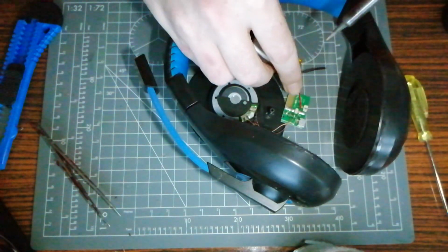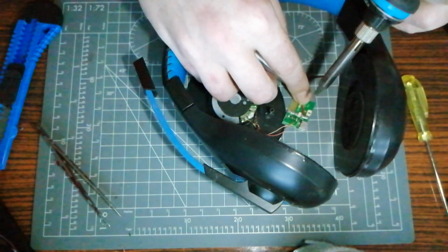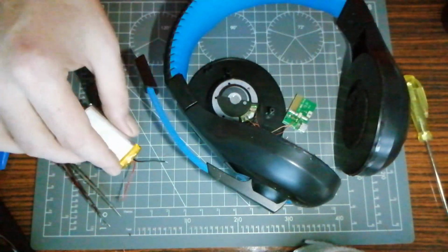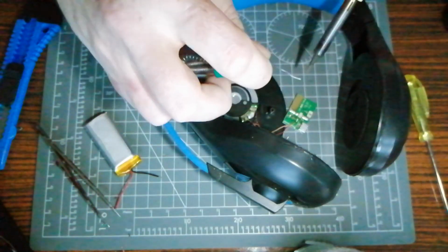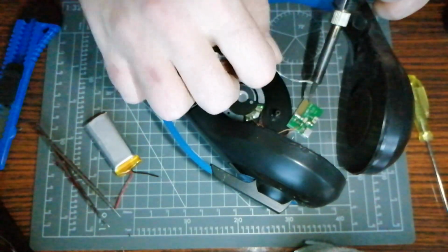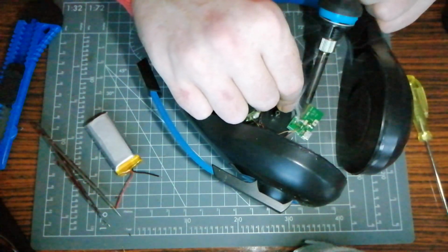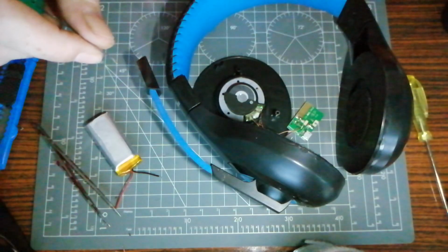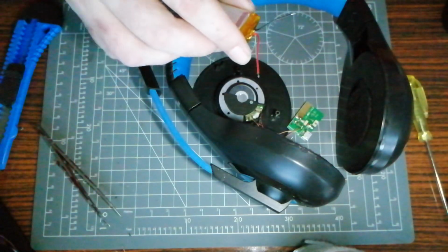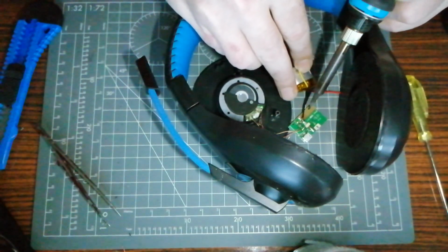Yeah, so this should be easier. Potentially one of the easiest bits of soldering I've done today. Bugger! I say that and I forget that I didn't re-tin the pads. Flooded that lovely jubbly. What I'll be doing as well is covering these in masking tape to try and stop any short circuits or anything. So if anybody's got concerns about that, they're probably one of the only things I'm slightly ahead of.